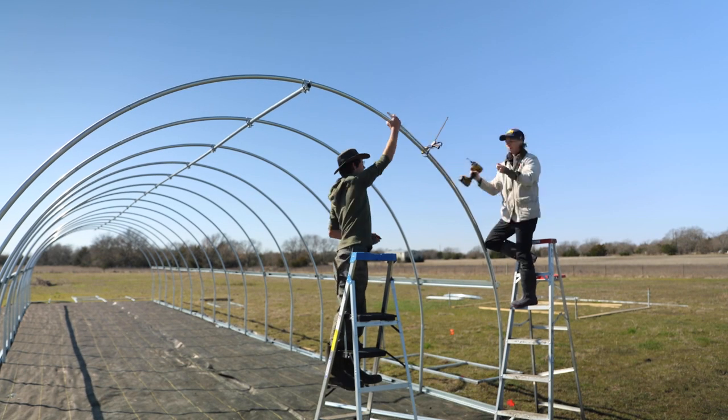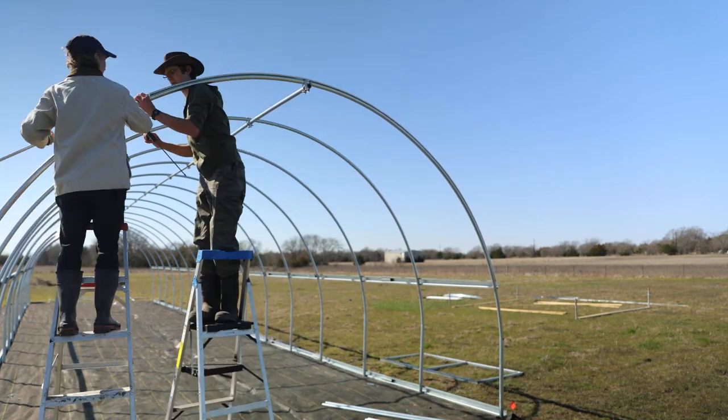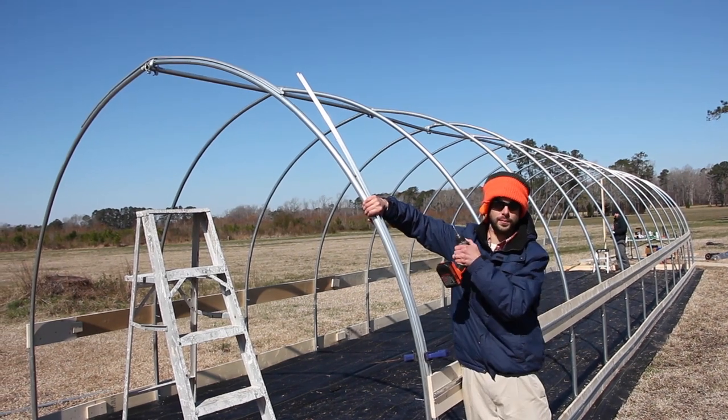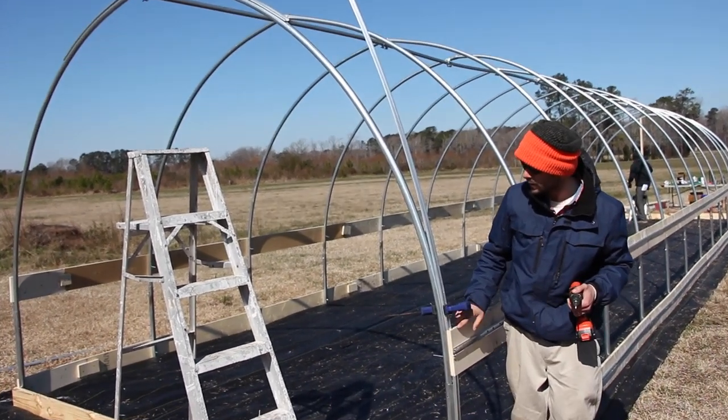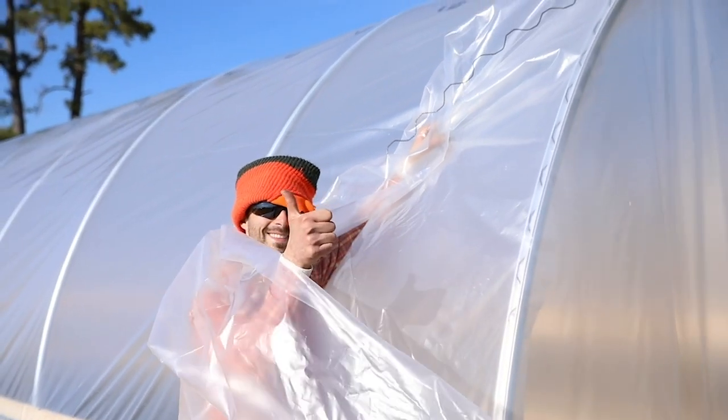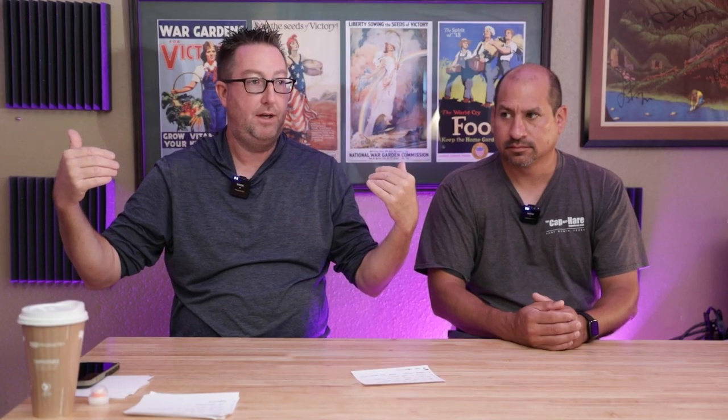The more layers you put in there it's going to be a little tighter, but tighter kind of works out for the best. On the hoops themselves, people need to understand that this aluminum lock channel is designed so that as you go over the top of your structure, the lock channel is on the very top of the hoop and it actually bends — you don't have to cut it or do anything weird. As you start installing, you put a screw or self-tapper in, use a clamp to hold it down, and work your way down. It bends really nice.